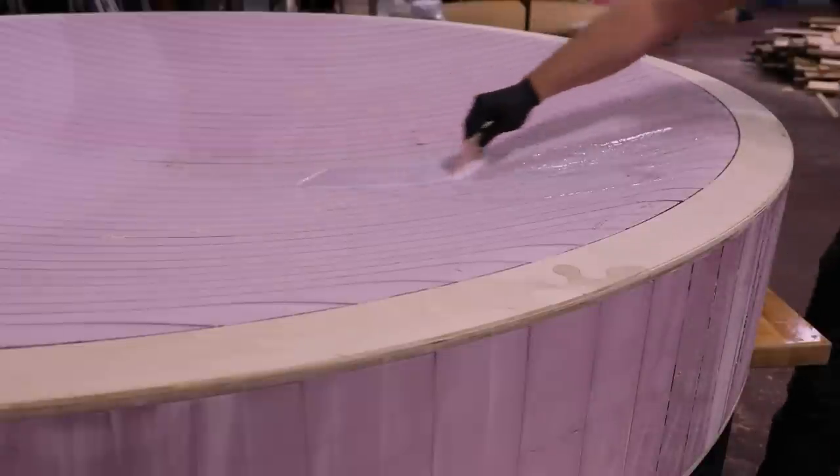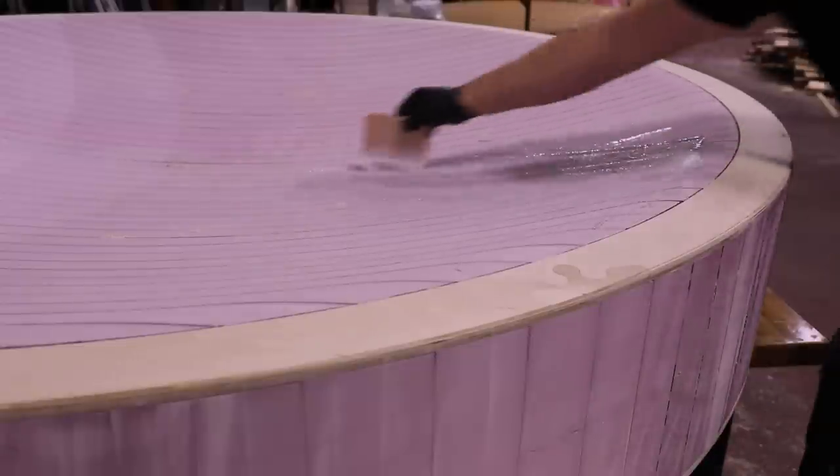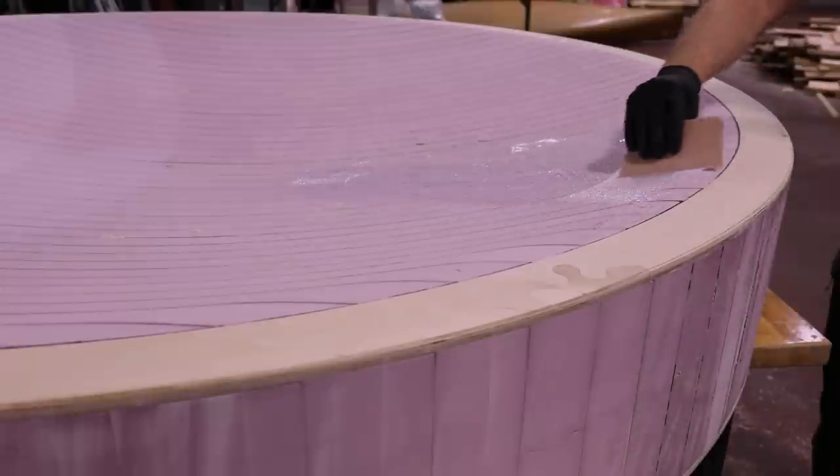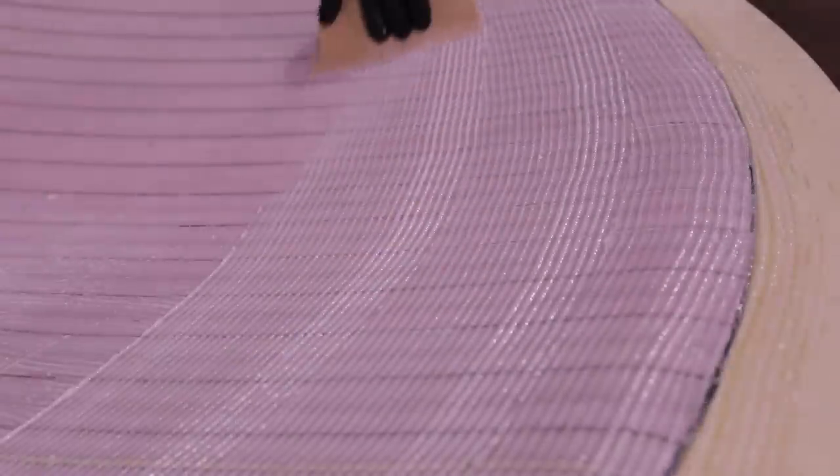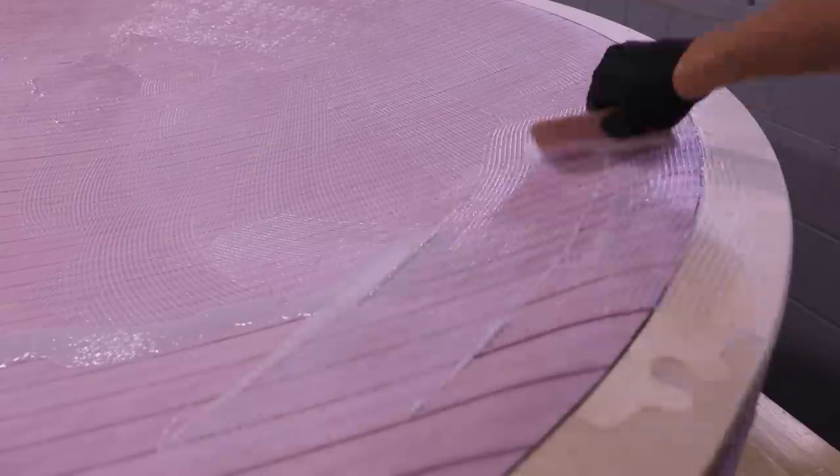I'll put all the links to the materials I used in the description. I made a notch tool out of a Bondo spreader. The notches allow you to quickly build up a surface evenly, as you can easily see the surface offset.